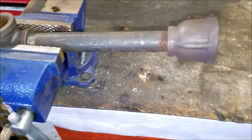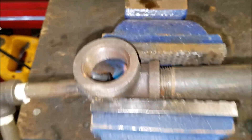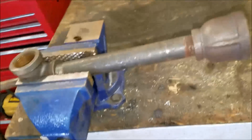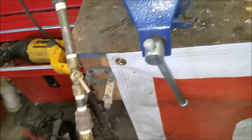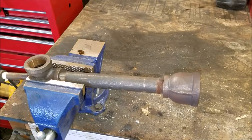Low pressure regulator from the grill. Here we go. See how it back feeds back in on itself? You do not want that. We'll do it one more time to show you what the low pressure does. It just doesn't even have enough pressure to push the gas back out down your line here, and that's only an eight inch nipple — that's not that long. That's why you can't use a low pressure regulator.